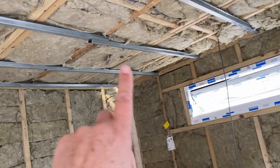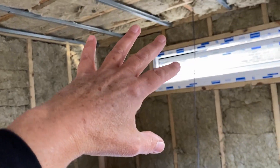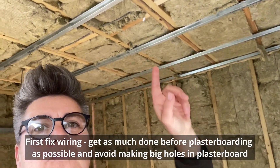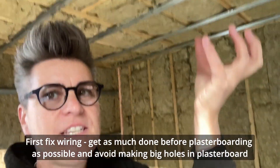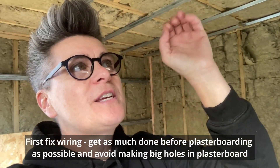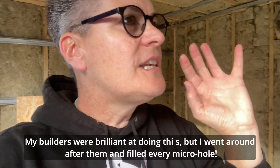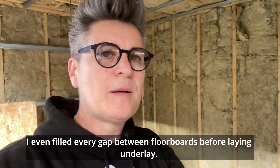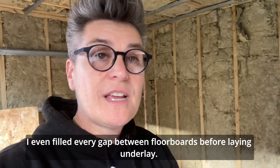I've got the wiring in going along here. I'm having three sets of spotlights - one in the middle, one at each end with three spots each. When you put in the lights, you don't want to drill any light fittings into the plaster. You want to make small holes in the plaster to poke your wires through, and then seal them all around with acoustic sealant, so you've got the least amount of holes puncturing your plasterboard as possible.